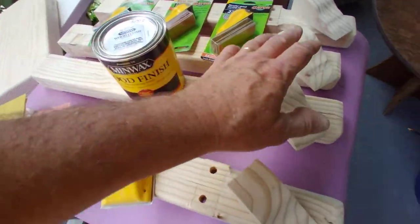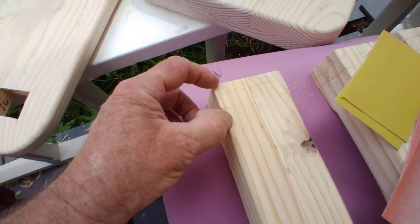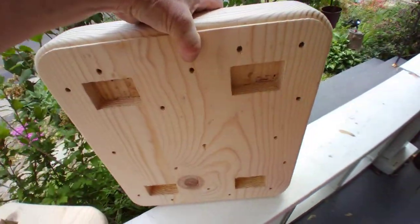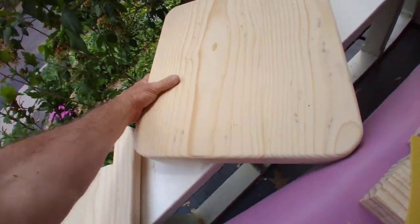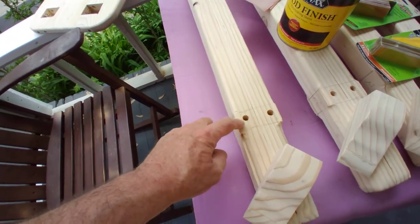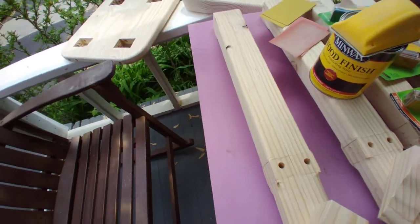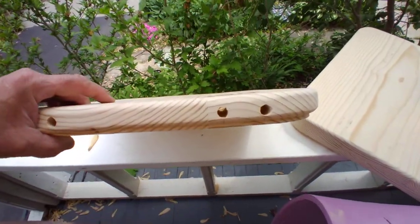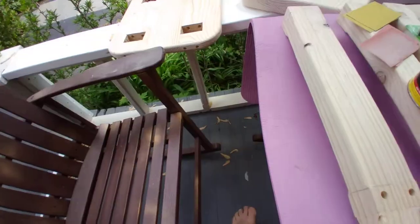I am now finishing up the legs. Look at the legs — they have a very interesting shape to them. This is going to be received at the bottom, underneath part. Please follow the series on making this from every step of the way. In the previous videos, you'll have noticed we're putting dowels directly through — this is the stool part — directly through the side, through the post, and then to the inner part of that footrest.